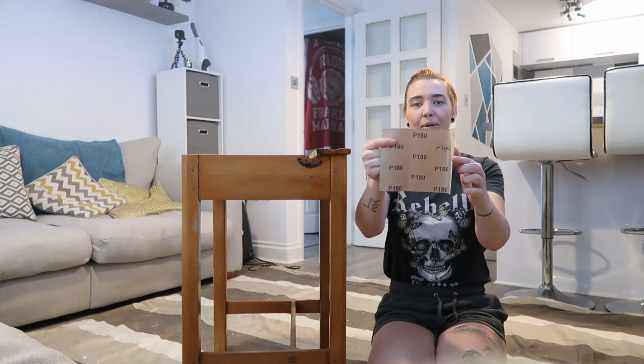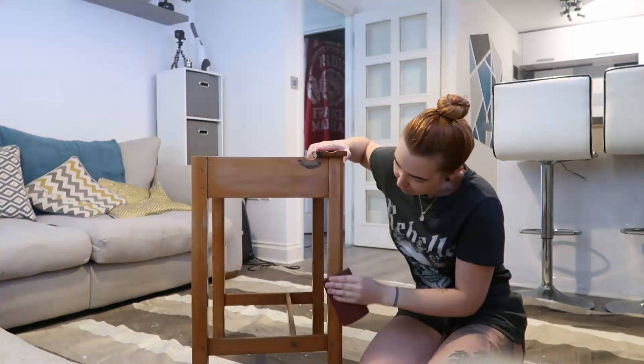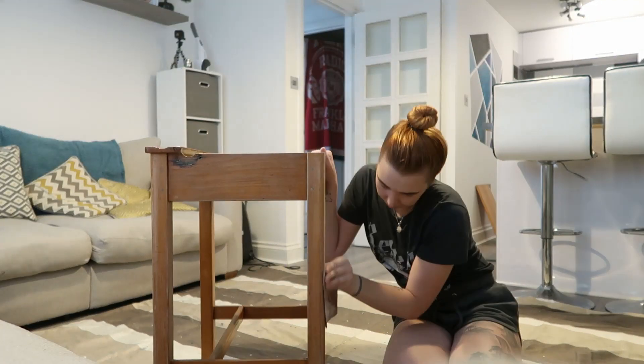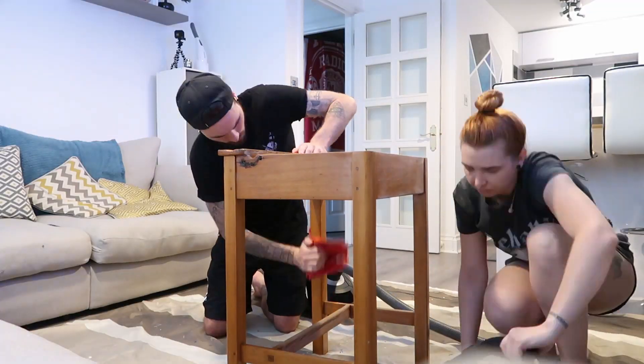The unit is dry, so we're going to give it a scuff sand using 180 grit sandpaper — and Dean's going to watch me do it. Once it's been sanded, vacuumed, and cleaned with a damp cloth to get off any dust, one thing I would say — which we always say — is preparation is key. If you don't prep your piece well, you're not going to get a great result. So make sure you prep it properly. We're going to let this dry for another minute or two and then we can start priming.